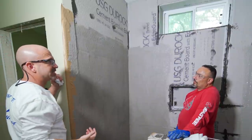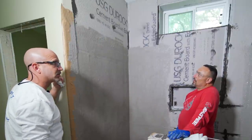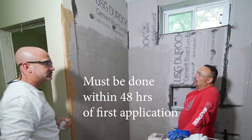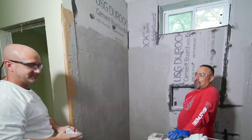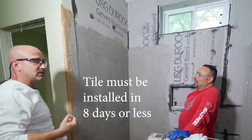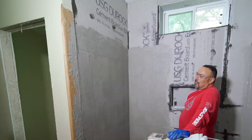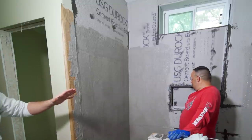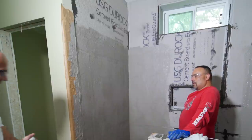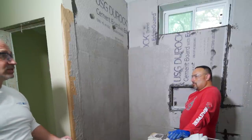Let's say you bring in materials and you're ready to go — going all the way to the ceiling. You will protect your ceiling; you don't want to get polyurethane and epoxy all over it. So do your tape job, protect it, bring it down. How far over should you go? Minimum two inches — I'm going to say that a hundred times. Whatever is in here, make sure your overlaps are right where you truly get a waterproof. You have to picture this: let's say you wanted to seal this whole thing off and fill it with water. Would it hold all the water out? Is there a weak point in that corner or did you put your insert in there? If the answer is no weak points, you've done your job.